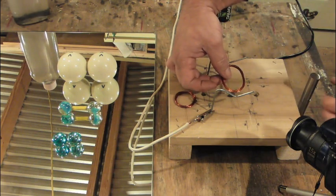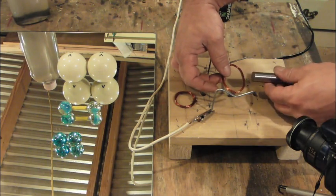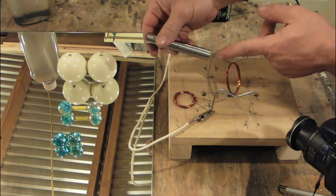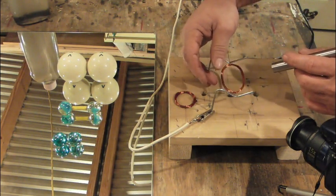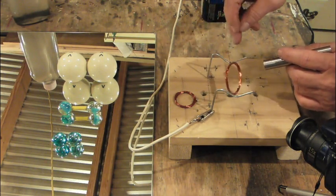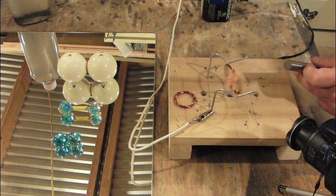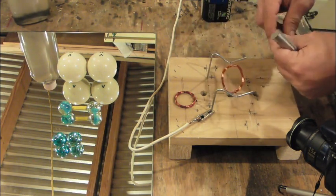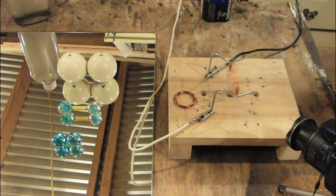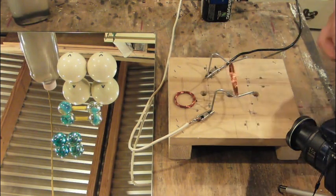So it's on and off, and that has to be at the proper time, where the magnet is at its 90-degree deflection or somewhere around that, so that the magnet pushes when there's current involved. If it stays on all the time, then the magnet will only have one push. So that's why it has to be pulsed, and you'll see that if you don't put a magnet near it, it doesn't work. In fact, it'll sit there and cry.